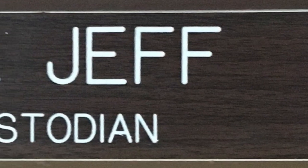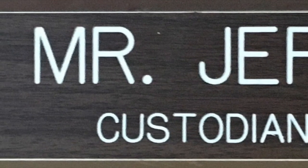There are going to be three — maybe four — things that we're going to do to our machine today. We're going to change the pad, rotate and flip the squeegee over, clean the filter, and check the batteries on this machine. We're also just going to wipe it down and clean it up.